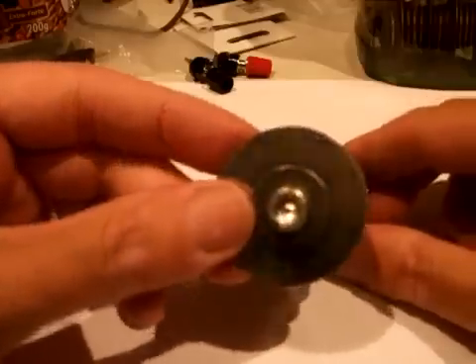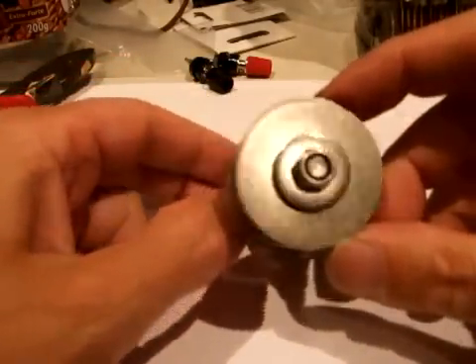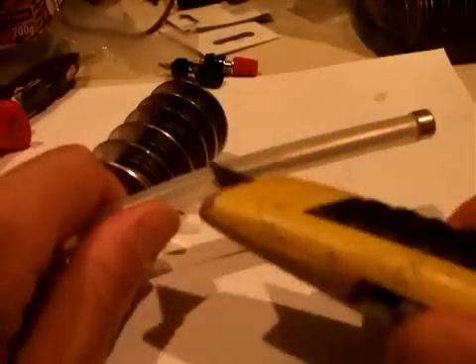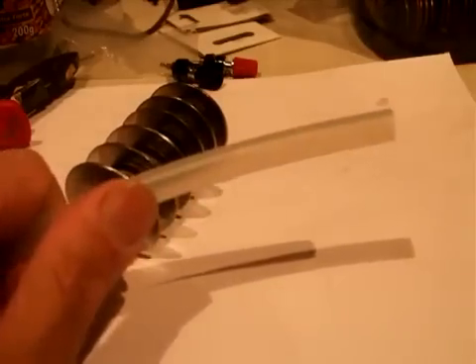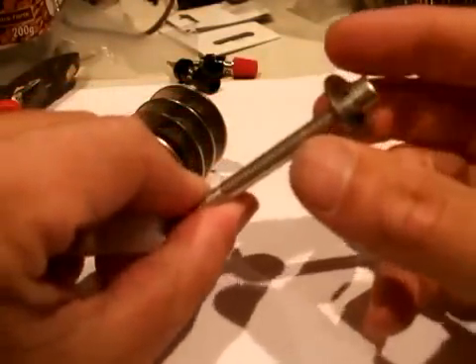In this section I'll be talking about how to make the cell. This cell has 6 large washers, which is slightly bigger than the other cell because I'm going to get this one going in a smaller coffee jar. It has a good solid lid for drilling and the cell will fit diagonally in the bottom, which is ideal. Here we've got the bolt going into protective pipe sleeving to stop any of the washers from making contact. You can easily cut this to size using a Stanley knife. On the end of the bolt it does have to have a washer because the size of the head is too small for the other washers, which would slip over it.